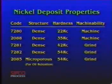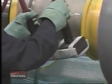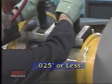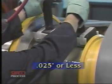In most cases, nickel deposits are used to restore the bearing seat. Depending on surface finish and thickness requirements, many diameters can be plated to size with little or no need to post-machine. Diameters requiring 25 thousandths or less provide the most benefit because resizing can be accomplished in one layer.